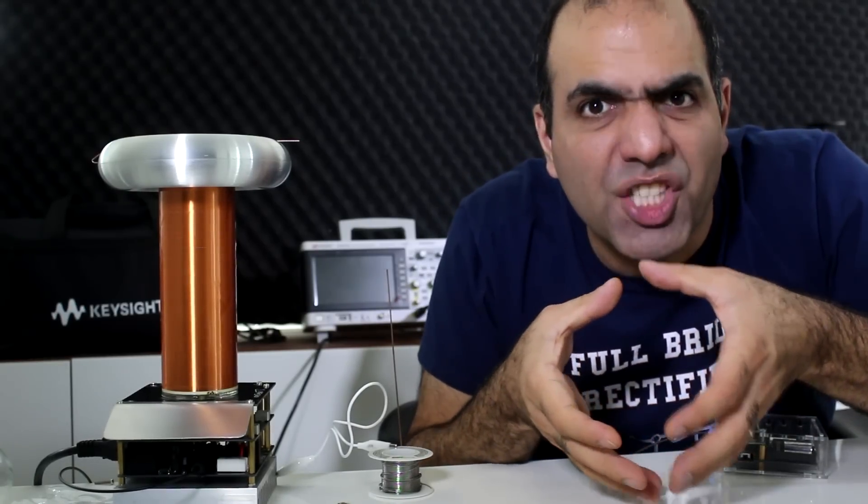What do we have here? A low power full bridge rectifier! And here's a cute little transformer. Like a traditional wall adapter, first there's a transformer that steps down 120 volt AC into 12 volt AC which has 17 volt peaks. Then they feed that into a full bridge rectifier and a capacitor that generates around 16 volt DC. Then that 16 volt feeds into 15 volt and 5 volt regulators to power the low power circuit. Most solders come with something called flux — it cleans surfaces to be soldered from oxidized layers so soldering is easier, but the flux creates fumes that are not very good for health. There are fans you can buy that suck the fumes away.